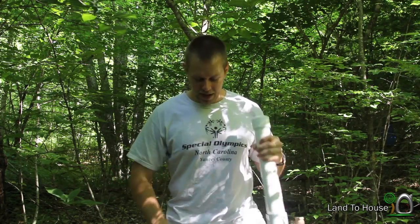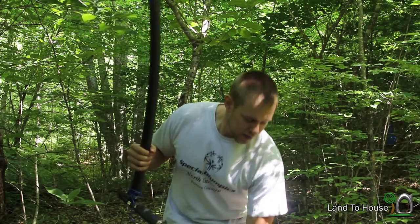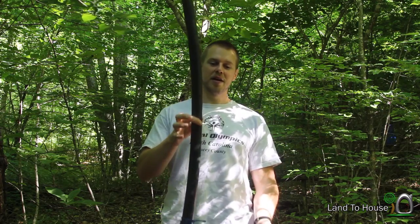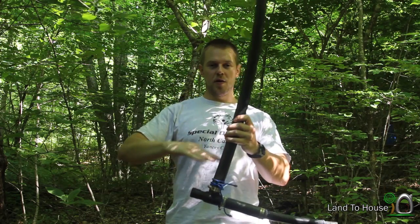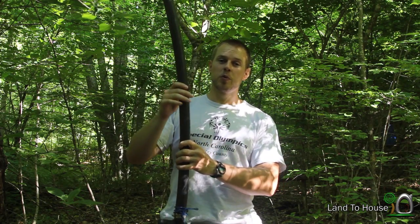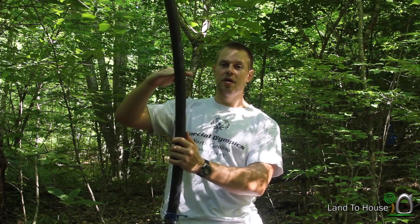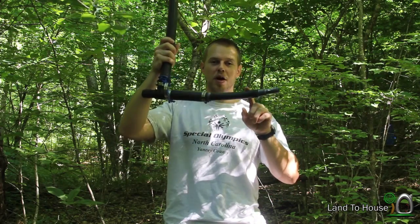So what I'm going to do is connect a supply line to this standpipe I've made, and that will allow the water from this bigger pipe to flow down and raise into this standpipe. Essentially, we're moving the source of our water to this pipe but getting a lot more feet of head from up above our drive pipe.